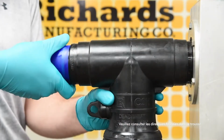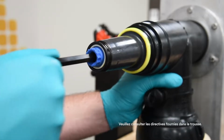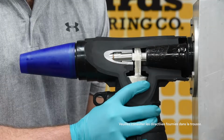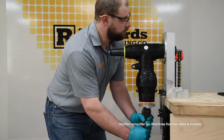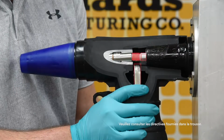Insert supplied disposable hex tool or approved alternative tool into CS8 load break interface and engage hex broach of fastener. Rotate tool 2 to 3 turns to start thread engagement. As an additional check that the stud is through the hole in the lug, tug on the power cable. Only a small amount of movement should be possible. Any significant movement of the cable indicates the assembly is misaligned and the seating step should be repeated.